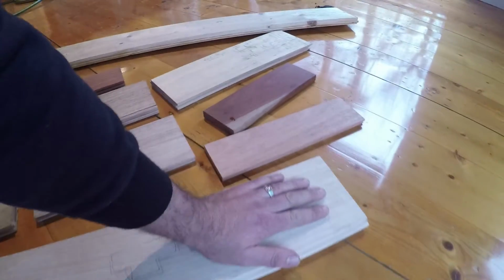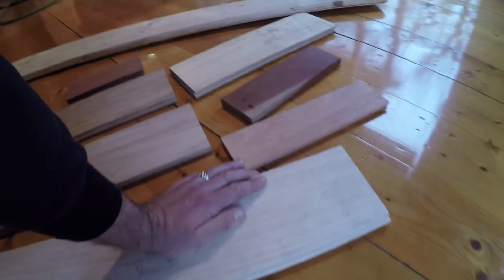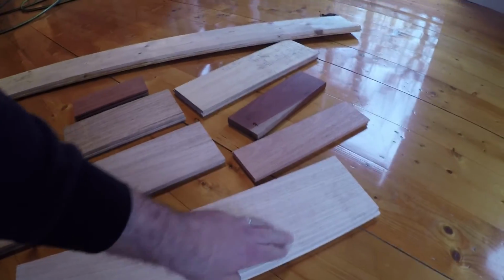Vic Ash is a eucalypt and it can be grown outside of Australia. It's very popular to be grown outside of Australia, and then people import it back in and it does not have the same strengths and usable value that the Australian standard of hardwood does. So it is a good board. It's soft underfoot, which is really good, but it dints up a little bit easy.